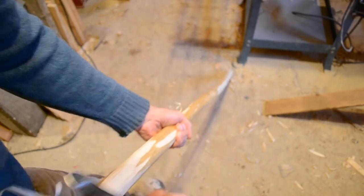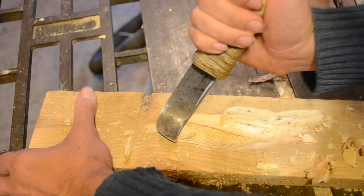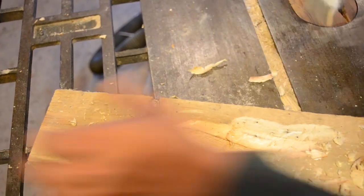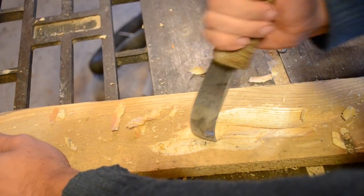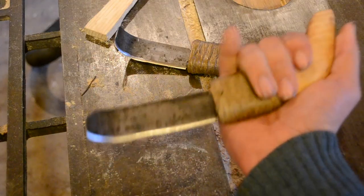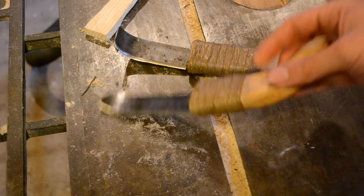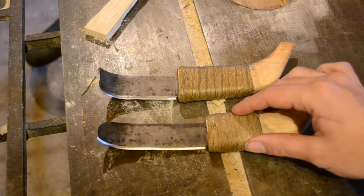It's also a little bit less efficient and you have a little bit less control. Similar advantages and disadvantages apply when using it as a gouge. Because the left hand doesn't have to use a hammer, you can hold the piece steady and don't have to clamp it, but the drawback is that you have a little bit less control. So that's the crooked knife — an extremely versatile tool, but like all things, it comes with a compromise. Thank you for watching and I hope you found this interesting.